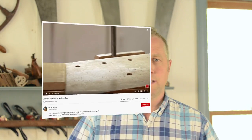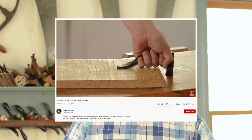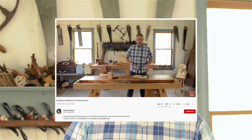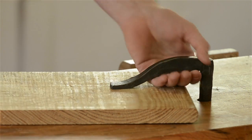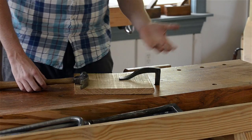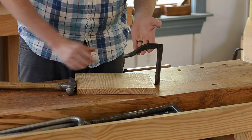I recently released a video where I talk in depth about hold fasts, so I'll just touch on it briefly here and summarize it for those of you who didn't see that video, and I'll link to that video in the description below. Hold fasts are amazing workbench accessories. You bore holes in your bench top, then drop your hold fast into one of the holes and hit the top of it to wedge your workpiece down. The hold fast wedges within the bench to hold it tight, which is really great when you're cutting a joint. When you're ready to release the hold fast, you simply hit it on the back and it pops loose. It's actually pretty cool.